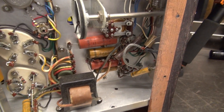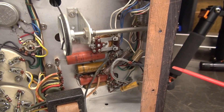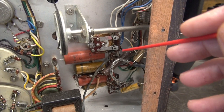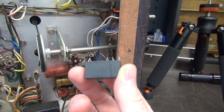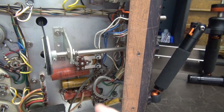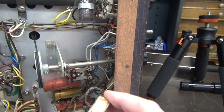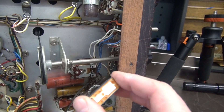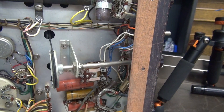Obviously there's no way I'm going to let this transmitter leave here with that hazardous condition. So what I'm going to do is remove this relay, get this power supply back the way it should be, pull out that resistor, and put in a 12 volt DC relay with a dedicated 12 volt power supply so that there's absolutely no shock hazard present. I use this system in all my Viking 2s — it's very reliable and very safe. I'm going to go ahead and remove those components, get the new push-to-talk system in it, put a three-prong grounded cord, and then we'll retest.